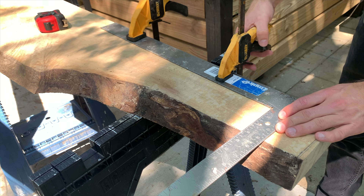We're finally ready to finish these tables. To do that we're going to sand with 100 grit, then 150, then 180. Between each grit we're going to water pop — spray it down with water, let the wood grain rise, and then sand better with the next grit. I'm using an orbital sander with 100 grit to start, going slow and as uniform as possible over the surface and sides of the table, taking care of any router edges as well.